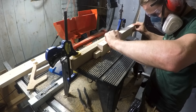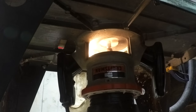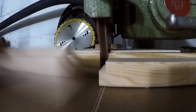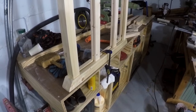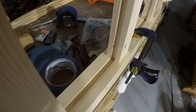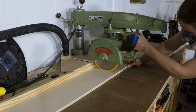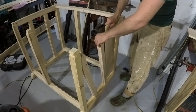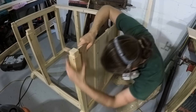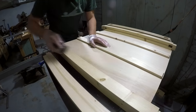Next up is closing in the end panels of the kitchen island. I use a half-inch router bit to rout a dado all around the pieces — the legs and upper and lower rails — then use some slightly planed-down two-by material ripped to width to make center divider pieces that receive that same dado, all cut centered in each piece. The panels themselves are cut from half-inch birch plywood using my track saw, then cut to length on the radial arm saw. They slide snugly into those grooves, giving a nice simple paneled look, and the plywood keeps the panel stable without expansion and contraction concerns.